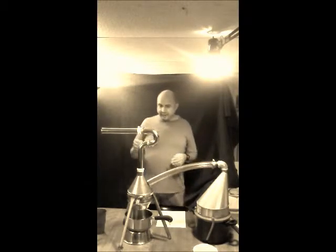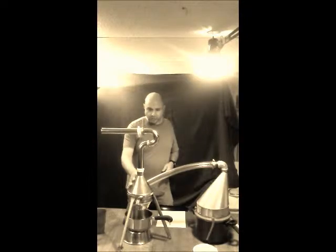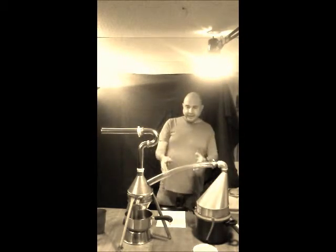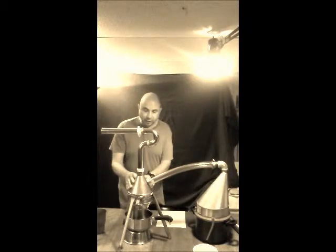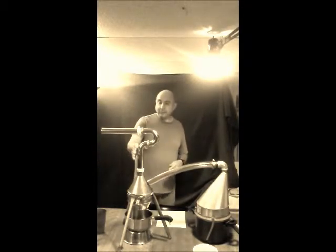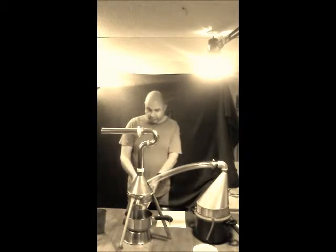The second area of condensation catching occurs out of this dome. Steam flows down this tube and it condenses, flows into the dome and out the bottom. Again, steam also condenses on the interior of the dome and flows out the bottom. Steam also condenses in this chimney part right here and flows out the dome at the bottom.